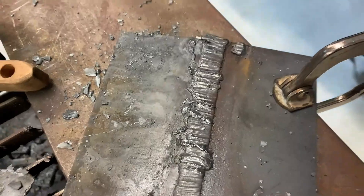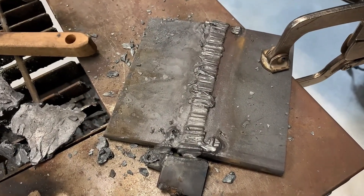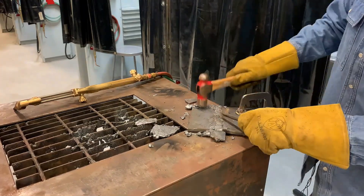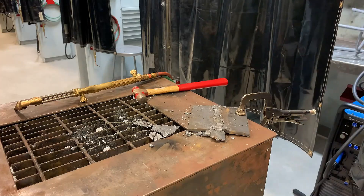Now this may take a little bit of practice. So if you're feeling uncomfortable, if you feel like you might gouge a little bit, you're better off leaving a little bit of material on there and just grinding the rest with the angle grinder. Once you've got that whole backing bar completed, you're going to see a whole bunch of slag that's easy to remove. We can remove that with the chipping hammer and then finish it off with the flapper wheel, get that nice and shiny, and prep for cutting our coupons.